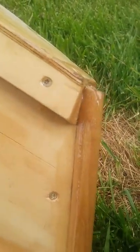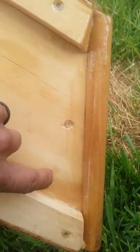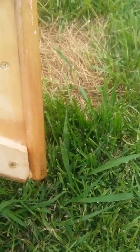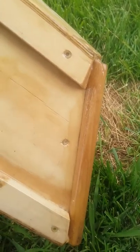The resin's still drying — I'll drip it over it. There's my nose. I got a piece of 2x4 in here cut at 33 degrees on two sides to make the triangle, and it comes out to about right here. I put this on here so I'd have more of a solid bumper — if it hits something, all the forces get distributed between the chines and the top rail to the whole boat instead of just one part of the boat.